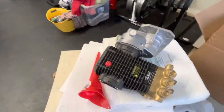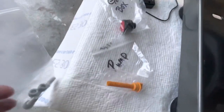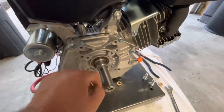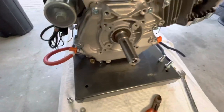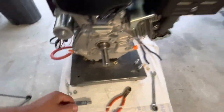We're going to go ahead and get this set up now. This pump comes with shipping caps — you've got to change those. They're right here. It's pretty self-explanatory: there's the gearbox side and the pump side, plus some other screws. We're going to be using these four holes here on the outer ones. I'm going to go ahead and put some anti-seize on this shaft just to make things a little bit easier, and we're also going to be using a zip tie to hold our keyway in.